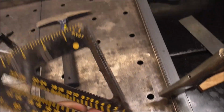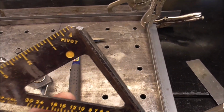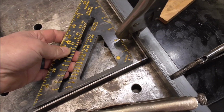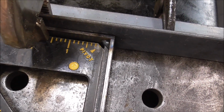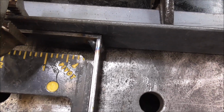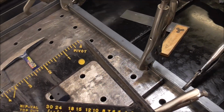down. And this is another great thing that you guys can do. I just take a regular cheap framing square and just snip the corner off it. So if you look down in here, you'll see why. See that weld down in there? That way, when you want to square something up and check it for square, you don't have to worry about if you have an inside corner weld getting in the way. So that works nice for that.